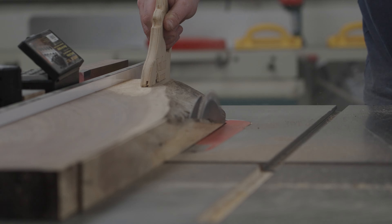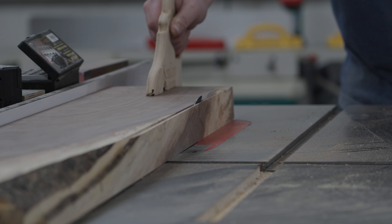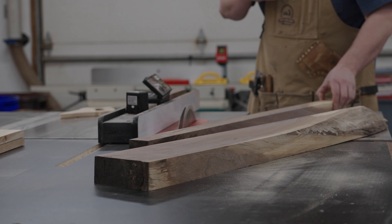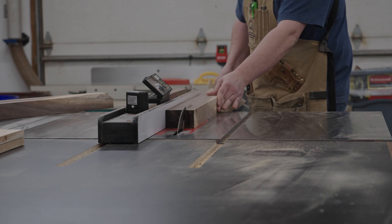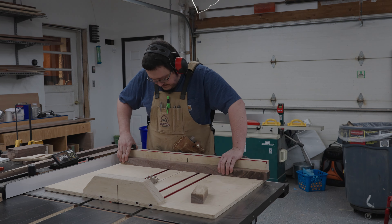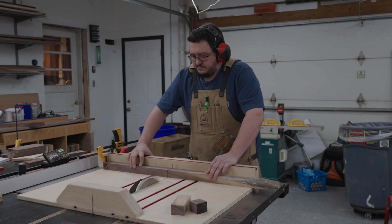With this material being so thick I would have normally done two passes with my blade, but I just had this blade sharpened so it just melts through the walnut. After cleaning up the sides I'll rip everything down to the appropriate dimension, then take it over the planer and plane everything down to about an inch and a half. After planing I can cross cut everything down to their actual sizes. The front two legs are going to be about half the size as the rear legs — the front legs stop at the drawers and the back legs go all the way to the tabletop.